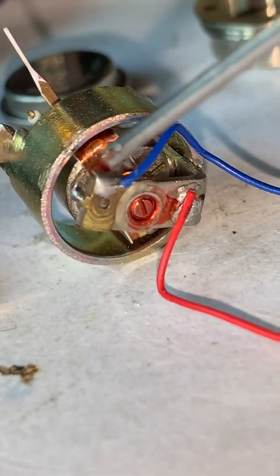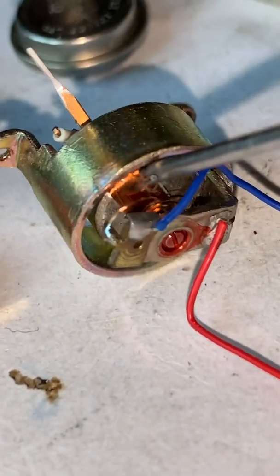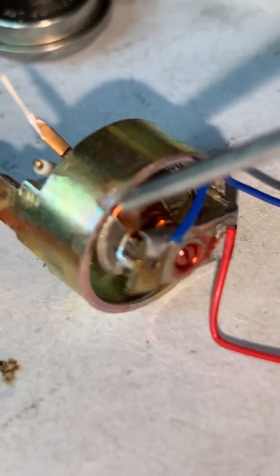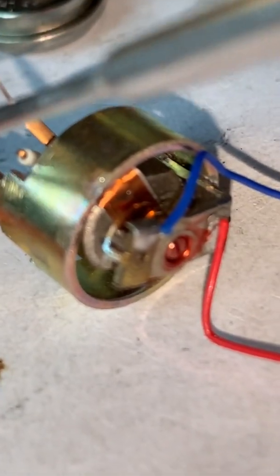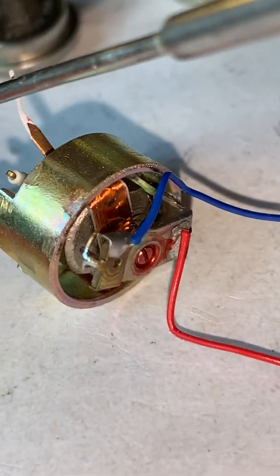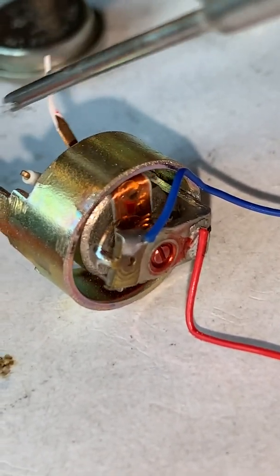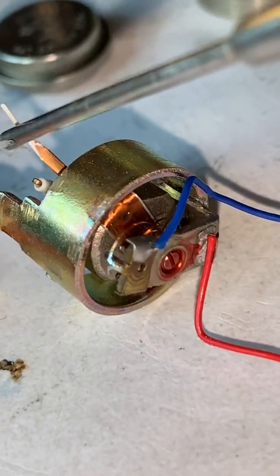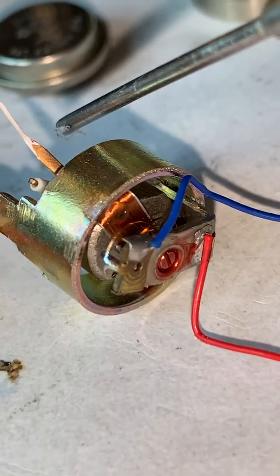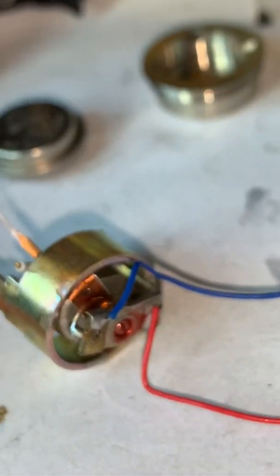There's a little connection right there that makes its way down to the other hairspring — there's another hairspring in there. You can just barely make it out. If I move this you might be able to see it — there you go. You can also see the many thousands of turns of the galvanometer itself. So you have current flowing in from that side, going all the way through the coil thousands of times, and making its way out through the blue wire. That's how this works — it's kind of interesting actually.